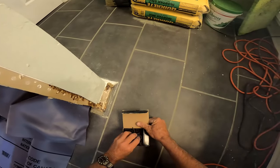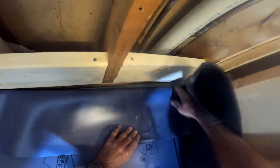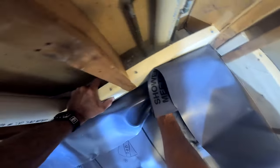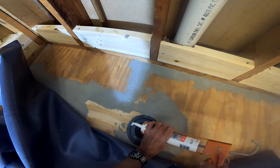A lot of homeowners get a little intimidated by the corner folds because there is going to be a bump out. You could theoretically push the excess pan liner into the corner gap between studs — other tile guys do it that way. I think I'm getting ready to do some caulking on that bottom flange. There's a little rim, an indentation, and once you have your pan liner situated, that's when you run a bead of caulking right on that ridge.